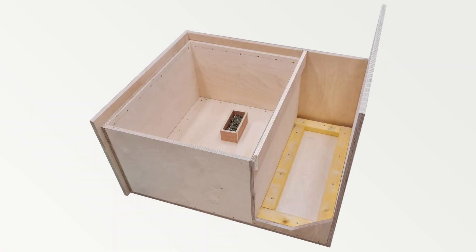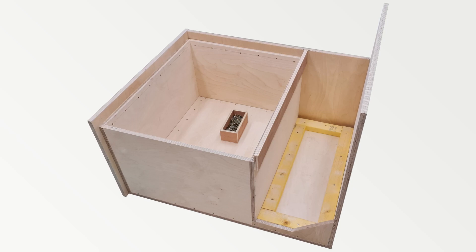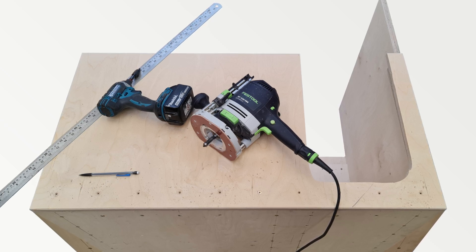I put a temporary piece to try out the saw, and I also made an angled piece for the front right corner but I didn't like that and changed it later. Once ready, the external skin is screwed at the top from the inside and directly to the CLS base at 100 millimetre intervals. I revised the piece for the front right corner to give better support for the right side. The outer front piece was part-fitted and rough cut before using a trimming router bit to match the inner skin.